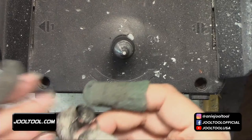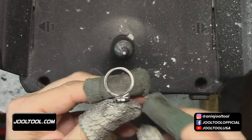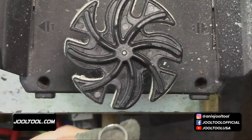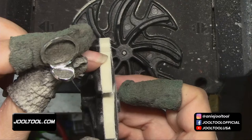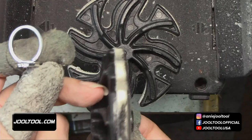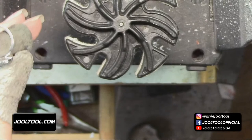So let's get started. I know these things take longer to put on than anything. So I'm going to go ahead and polish the side right here, and I'll show you guys how I do this. So I'm going to take my felt wheel. And remember, if you're polishing all the way in here, it's really important to have a felt wheel that is very sharp on the edges. So just like Myra said, if you can have more than one of these felts, it's really good. Because after a while, when you do rounded dome things and curved stuff, your felt starts to become like a little flying saucer. Mine not so much, but a lot of people's are. So this one is perfectly crisp, and there goes everything.